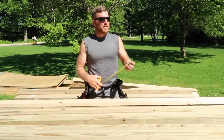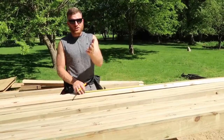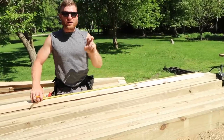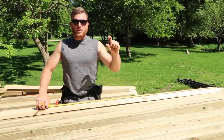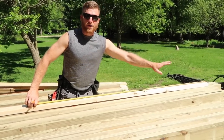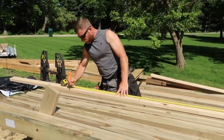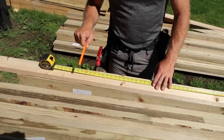The key to efficiency when making up your posts on the ground is a story pole. That's just a two-by-four, or it could be a two-by-six — some long piece of wood you're going to keep and use on every one of your posts. The bottom of this two-by-four is going to be our grade. That dimension from the bracket plus one and five-sixteenths is the bottom of this board on our posts. I'm going to hook the bottom of my story pole — this is a 12-foot wall — so I'm going to mark 12 foot. That mark is going to be the heel of our truss, the bottom of our truss on every post.